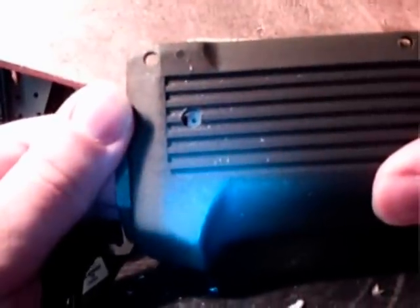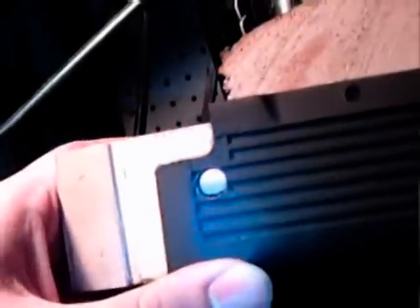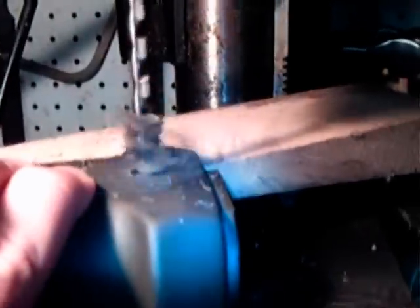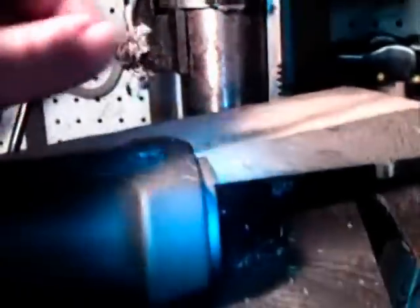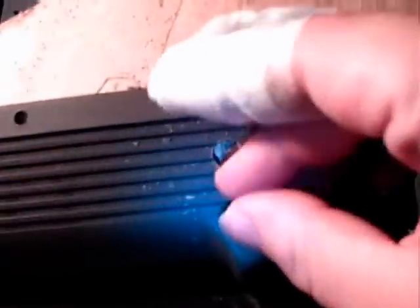You can see this hole is clean through and centered up nicely. Now all I've got to do is drill the one on the opposite side, which I've also sort of center-punched with the scribe. That will be done with a three-eighths inch bit to match the three-eighths inch hole down on the receiver end of it. There we go. Clean holes straight through — the holes now match pretty well. Very clean holes straight through. Now all that's left is to start reassembling.